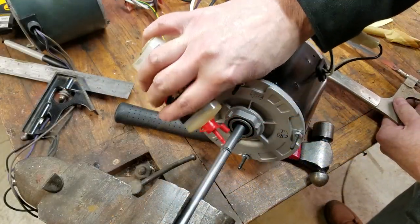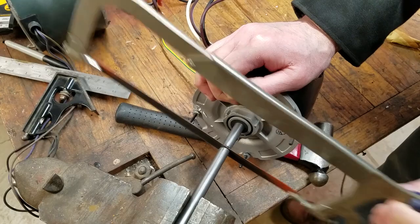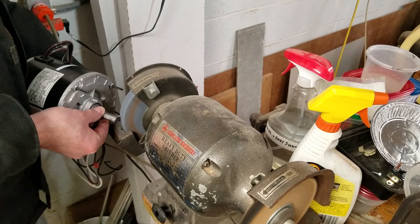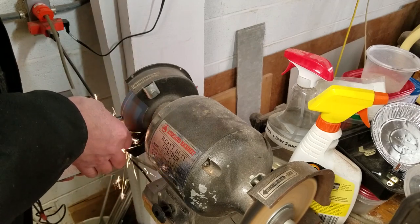Everything is okay, so let's get cutting. I did it old school since I didn't want to get abrasive dust from a cutting wheel all over the motor and possibly inside the bearings. After it's cut, I'll dress the shaft end on a grinder. Spoiler alert: I didn't trim the long screws on the shaft end of the motor — that will come back to haunt me later.